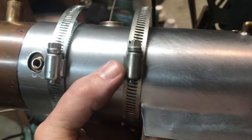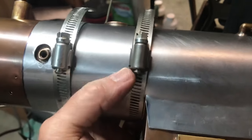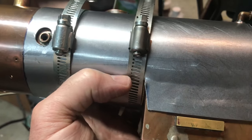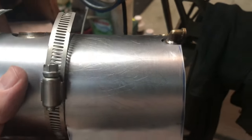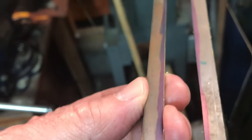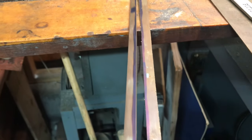I've made a note to grind a little bit off the steel jacket right here, but as you can see it fits nicely with the smoke box. The next step will be to make some actual brass bands similar to the ones I made for my Allen Mogul. As small as all this is, the clamp pieces I used on the Mogul wouldn't be practical, so I think I'm just going to use some brass strips and then blocks that I drill and tap to make a little screw and clamp assembly. Getting ready to make the little bands to hold the cover on. I decided a good width will be just over a quarter of an inch — about 300 thou. I marked it out and carefully band-sawed it, staying as close as I could to the line, and it came out really good.